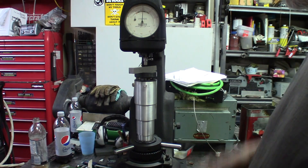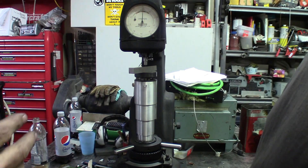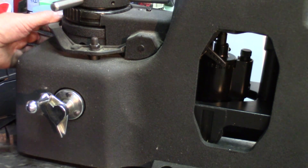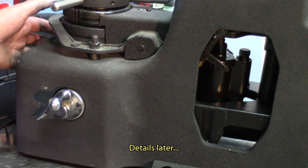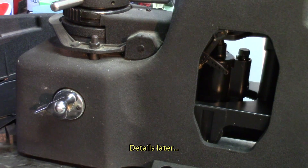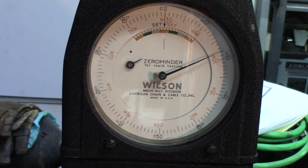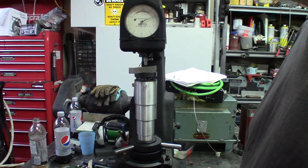We've preloaded the diamond point. Now Pierre releases the weights — there are three weights in the back, and with the mechanical advantage it's the equivalent of about 150 kilograms, or close to 320 pounds, being applied. We wait for the needle to stabilize; it takes about five seconds for the load to come down, controlled by a damper inside the machine.